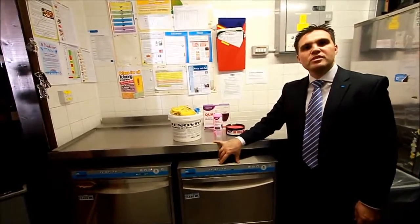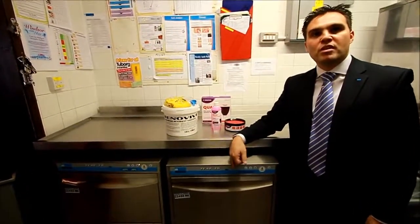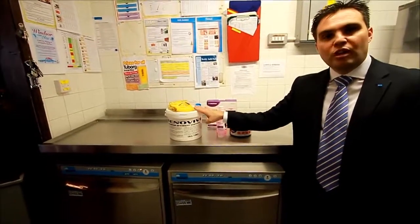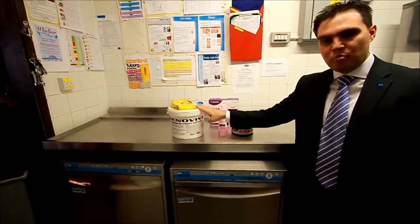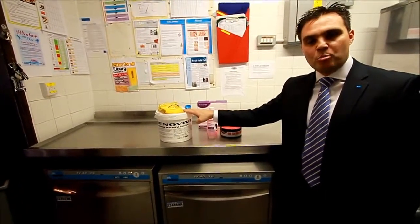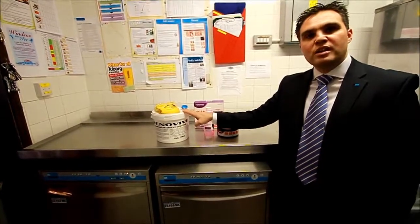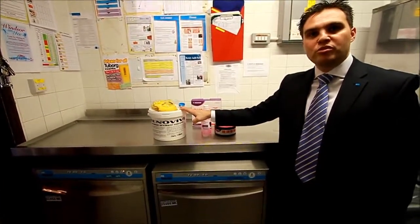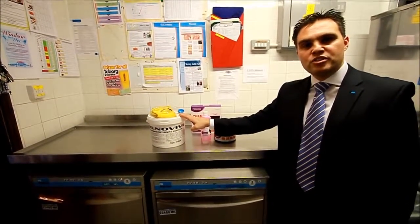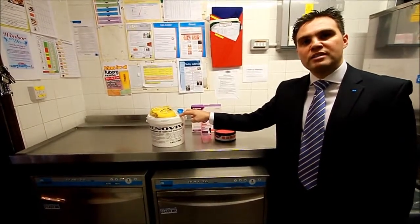Finally, the most important tips for this machine are obviously the info 520 to make sure that the machine never runs out of detergent or rinse aid, because the machine will stop. Also, it's important to understand that once the renovation process has taken place, initially when the machine is installed and all the glassware at the pub is washed and renovated, any new glassware that's introduced along the line into the pub also needs to be renovated as well. There is a film that appears on new glassware as a release agent when the glass is made, and that will cause a problem if it isn't renovated before it's used.